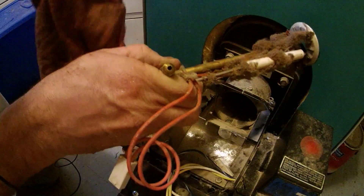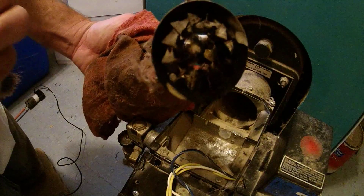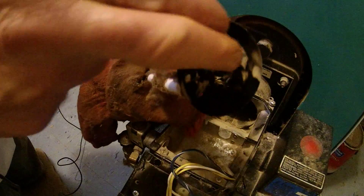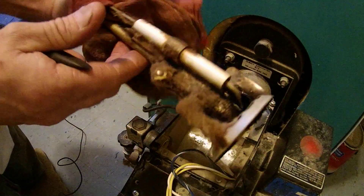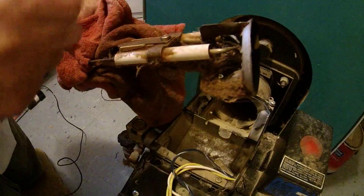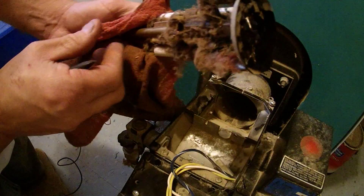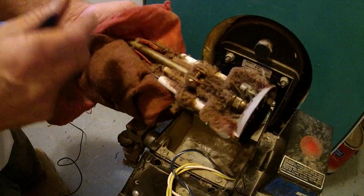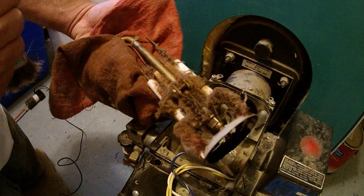Have your rag ready because when you start moving it around you're going to get some fuel coming out this side. I'm going to take this out to my shop, take a brush, and clean this all up — clean all these fins and get all the dust off. I'm not going to disturb the electrodes, I'm not going to bother the nozzle. I've got a service technician coming down to do a preventive maintenance anyhow. I just need to get this going for the night.